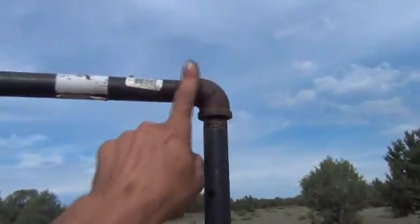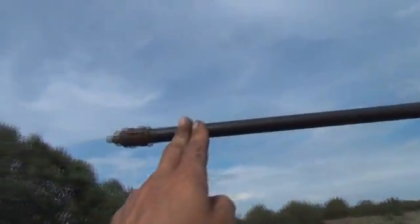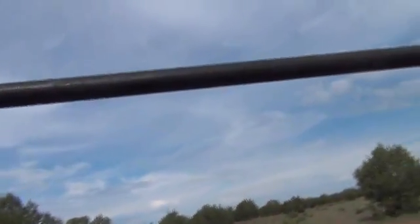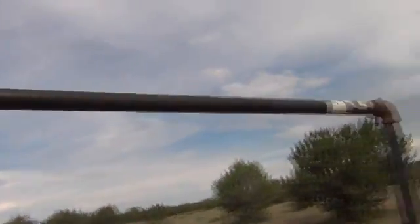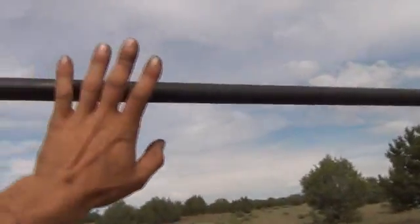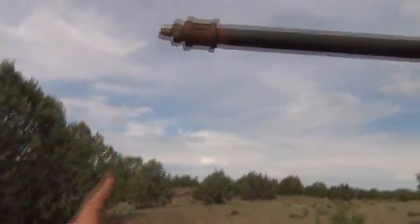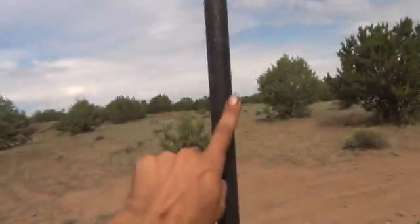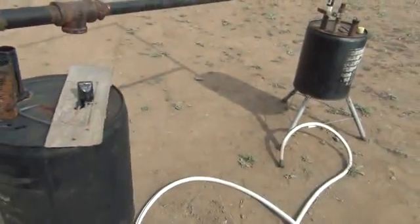Anything that does make it up is going to span four feet at a slightly sloping uphill angle. The same angle as the lower pipe slopes downhill, this pipe is now sloping uphill to match an equal. That'll help anything that gathers run backwards down the pipe to the junction and down into the catch, and also helps take some of the heat out of it up here. The heat being lost to this four-foot section will make sure that the smoke, once entering this point and dropping downhill, will be cooler. That'll help the thermodynamic process — an updraft, a cool-off, a downdraft — into the radiator and then into a condenser, which I'm going to get done today and show you in a video once I'm done.